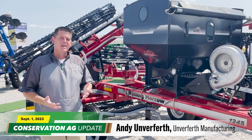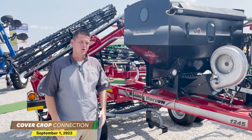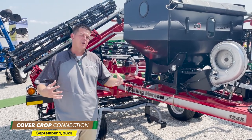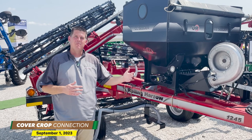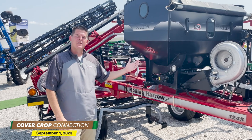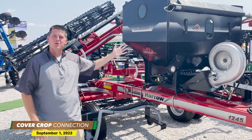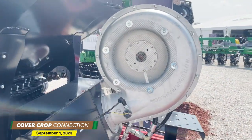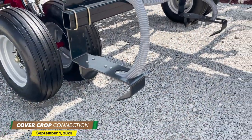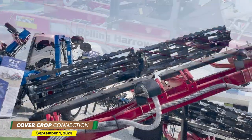This is a unique system in that we can plant cover crops quickly and cost-effectively. Drills can be expensive to run. Spreading your cover crop on the ground without working it into the soil, or making a pass with a spreader and then a tillage tool afterwards, can be more expensive. The cover crop seeder can do all that in one pass. We have a 32 and a half bushel hopper that drops down via our air delivery system to our deflectors, which spread the seed out evenly along the ground.